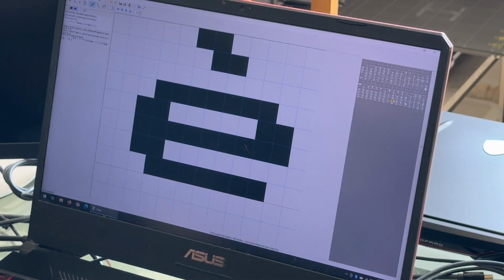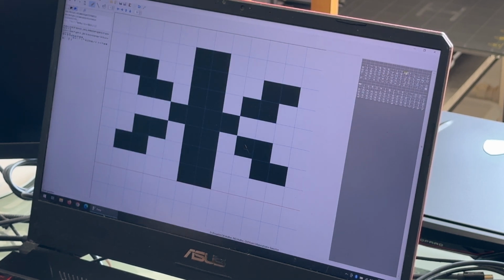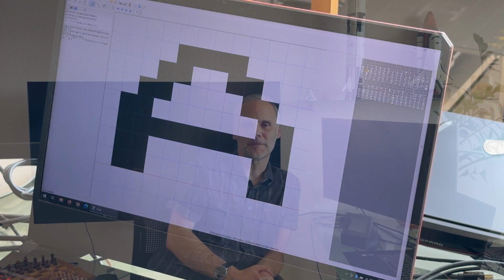I copied the pictures of these graphic elements, overlaid metrics, and bit by bit I inserted them in a font editor, and this was, as I said, for 500 characters. Next I tried to create a user interface for the PC. In my first version, the ITTS box was only an interface between the DCC player on the one hand and the PC on the other hand. And it works in two steps. I made a dump file from a DCC, and in the second step I tried to show this information from this dump file on the PC.